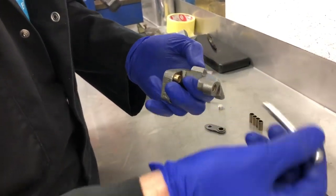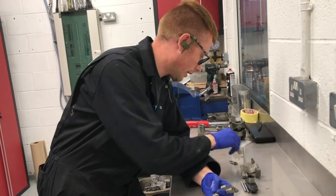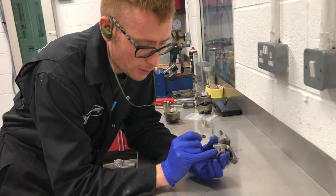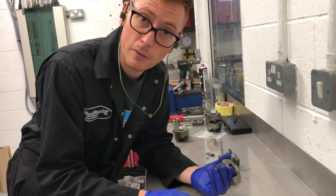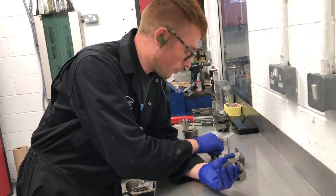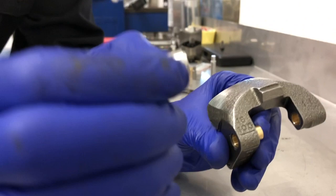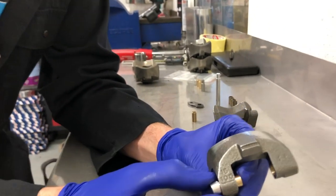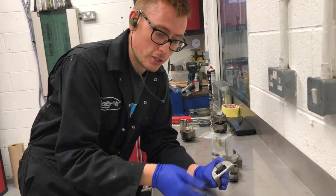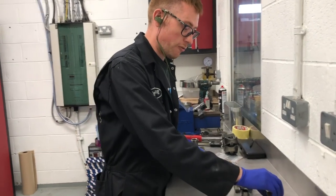We get these small bronze bushes made — they're a custom made piece and a very strange size, 7.01 or something bizarre — and they get pressed into these halves. We've got these little aluminium tools that allow us to press them in without damaging them. It is a little bit more complicated than just pressing them in — the ends of these flyweights are crimped, so if you push that bush in too far, even though the crimp may be only 0.1mm, it tightens the shaft and then doesn't allow the governor to work properly — it actually jams the pin. This little device here sits in the end and it stops that bush — it has a little step on the end — stops that bush being pushed through, and then crimped on the end, so that allows us to have a really silky smooth shaft fit.